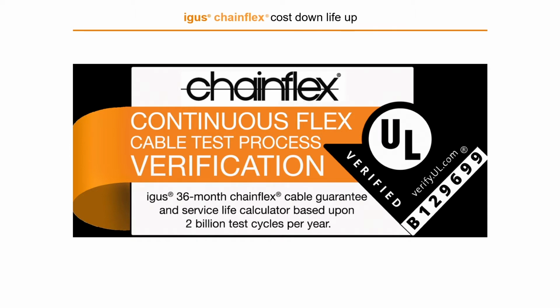This UL Verified program, which I'll talk to you about today, has been around for about a year and a half. And igus decided to work with UL to get our claim of 36-month cable guarantee verified. This cable guarantee is unique in the industry because it's based on a service life calculator that we offer to customers, where they can plug in the igus cable and the constraints of their application, and the service life calculator will give you a guaranteed service life, or the service life of the cable without a guarantee, but give you an idea of how long it will last if you're trying to push some of those constraints like bend radius or length of travel or temperature.